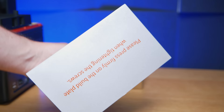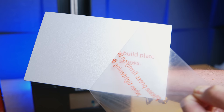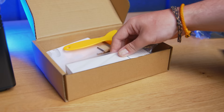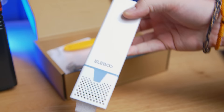The build plate, unlike other brands, isn't laser etched or pretty in any way — it's just sandblasted. But honestly I have fewer issues with this than any other printer. Those other styles may cause prints to stick more, but in my experience they often stick too much. With this, prints just slide off, and if you get your baseline exposures right everything should be fine. The printer also comes with one of Elegoo's now-standard carbon filters, which just plugs into the internal USB port to suck out a lot of the nasty smells.